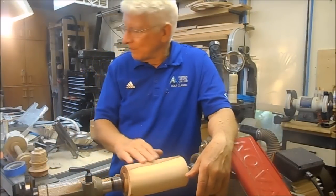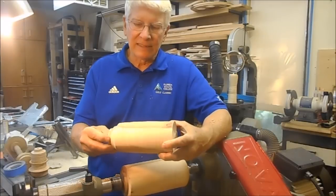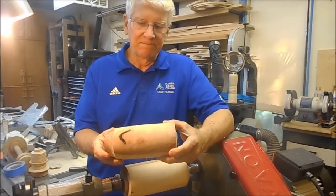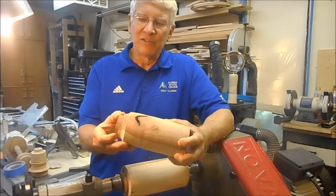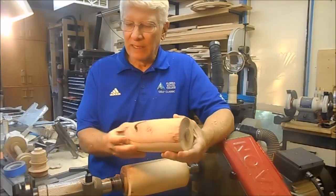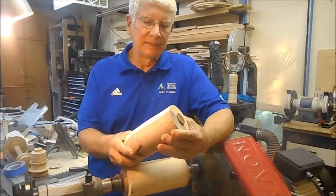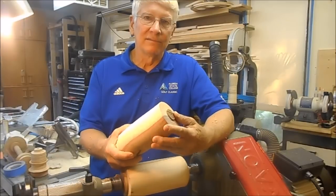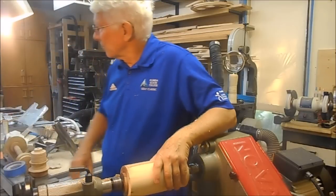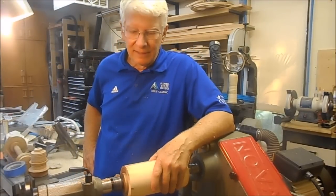About the art show, one of the things that I got some orders for there were the wooden mugs. What I'm doing right now, I had pre-turned some of these blanks. These are hickory to make into mugs, and I've just been pre-turning tenons so that I can just turn them around and begin hollowing things out. Once I get that done, I'm going to let them dry. It is green wood, and I've got some cypress and those, and about 8 or 9 other ones that I need to get done.